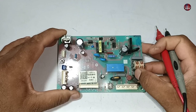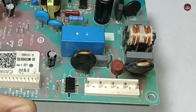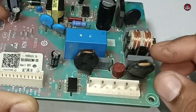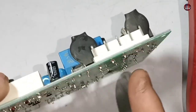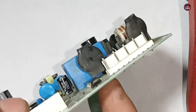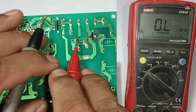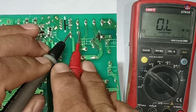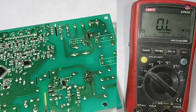I have installed the new capacitor and fuse. But we didn't yet look at the ZNRs, because if a ZNR gets short-circuited, it could cause the issue. I will set the multimeter on ohm mode. One ZNR is installed on the right and the second on the left. The ZNR should not show a reading on the multimeter; if it does, the ZNR is likely short-circuited.